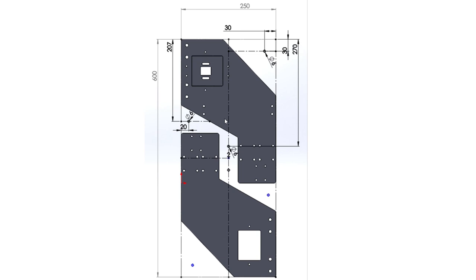The minimum width of the stock is about 250 mm, and the minimum length is around 600 mm. The reason that I need some space between the two pieces is that when I cut one piece, the bit can run in between the space here without cutting into the other piece. I will show you how I set up the milling later in Fusion 360.